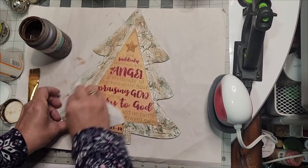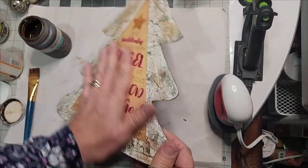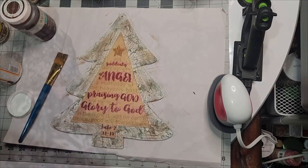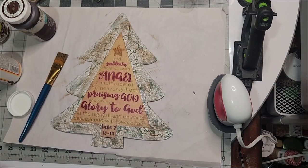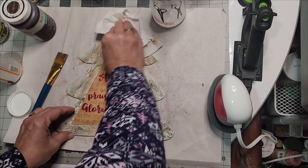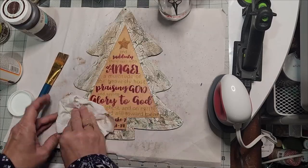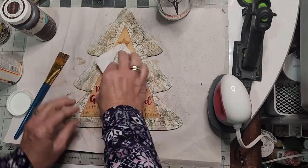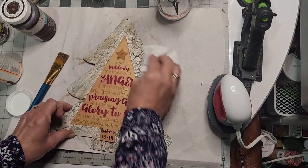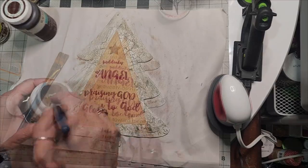Rubbing off the excess wax seals the wood, gives it a smoother finish, and makes it more slick so it won't be powdery. Then mist a little water onto a paper towel, a little bit on the sign itself, rub it — that will take off some of the stain if you got too heavy, as I did. It's just an easy fix to clear it up and smooth it out to get the color you want.